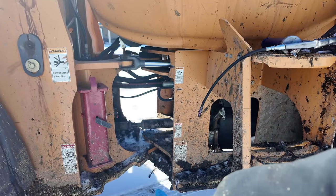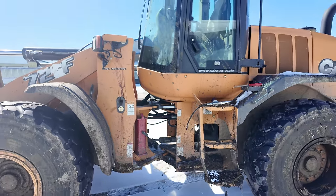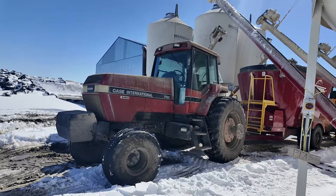But these are some of the most important grease zerks to do on the entire loader. The whole weight of the machine is on that point and that point right there, and they're constantly moving all day long, so we've got to keep grease on those.